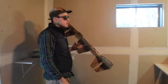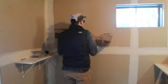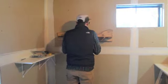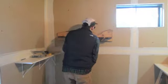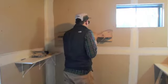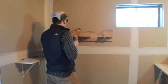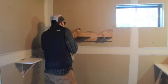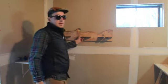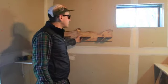and line up the protruding screws with the corresponding anchors which we installed earlier. Once you have the anchors lined up, just drive them home. Now that's just 2 screws, but once you go around and do all 6, you'll have a very strong ski rack. Enjoy.